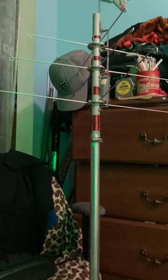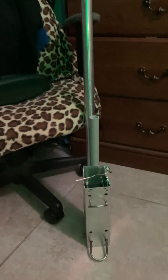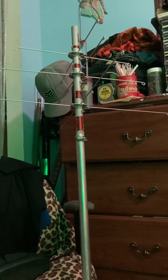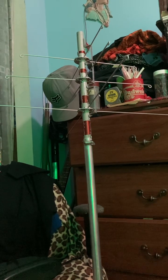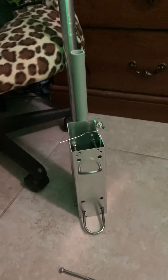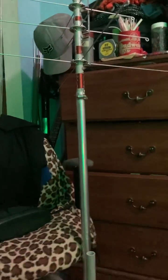This is the whole enchilada right here. Today I was using a 102-inch whip antenna as an experiment. I put an old pole out there — a 25-foot pole — with an old mount from an old house antenna, then put a ground plane kit on it, put the spring on, and put the 102-inch whip on there. I think it worked pretty damn good — five-and-nine signals. I'm really surprised. Maybe sometimes you need a vertical when the bands are really bad; verticals come in at a good place when the sunspot cycle's bad or there are disturbances.